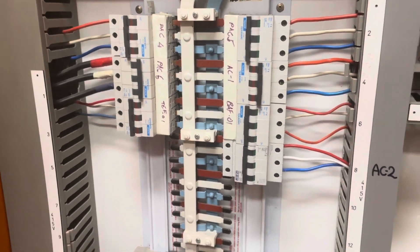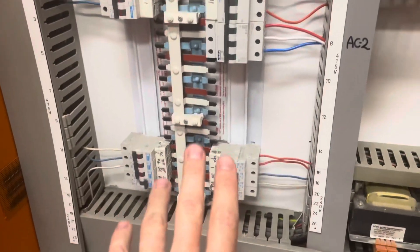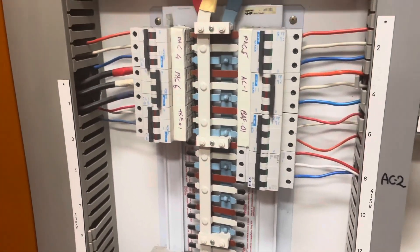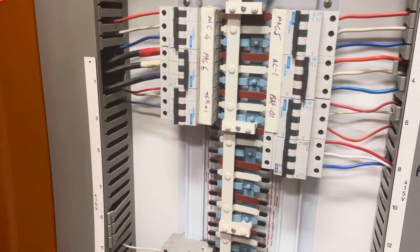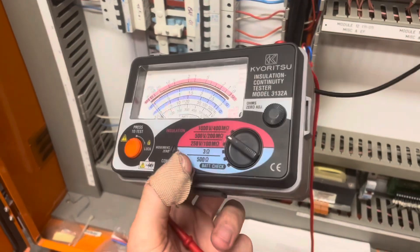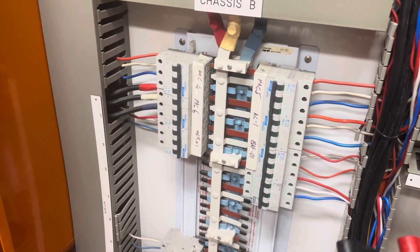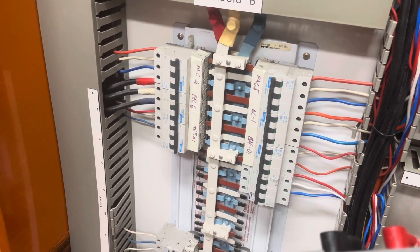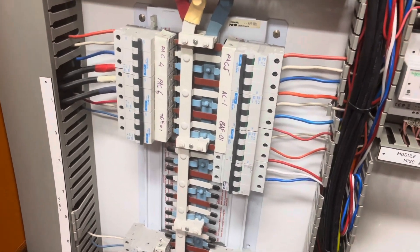Something's going on here. This is linked up to a BMS system. This is my first time at this site, so I'm still trying to work out exactly how everything's wired up. I've pulled out the IR tester just to confirm — I'm getting a lot of crazy readings. All basically reading down to earth on all legs on all of my package units.